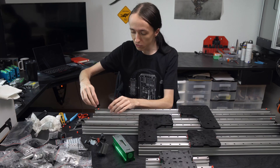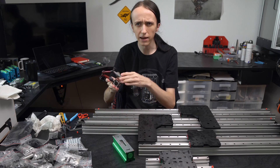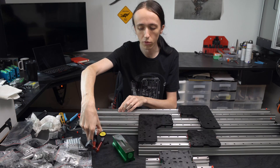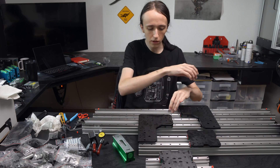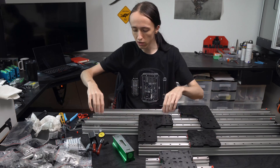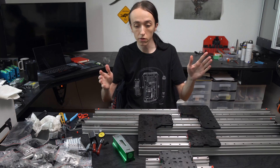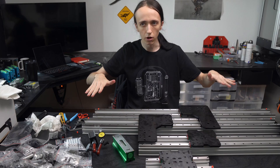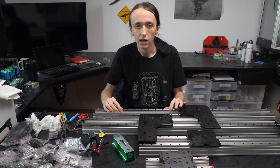What I did was use the aligner jig to get one end bolted down and then put a dial indicator on the carriage. I only turned the magnet on about half way, as if I turn it all the way on then the steel bearing balls inside are also attracted to the magnet too much and it doesn't roll smoothly anymore. But at about half magnet power it doesn't fall off, but it still lets me roll very smoothly. Then I went back and forth every 20 centimeters or so adjusting it until I got the whole rail parallel to the extrusion to about 30 microns, which is 0.03 millimeters. In case you're curious how bent these rails were — most of them were quite flat. One of them had a bit of a bow, but that gets automatically corrected by screwing it down. But bent the other way I saw as much as about 0.1 millimeter, which is quite a lot if you're not compensating for that.